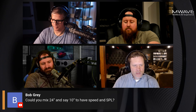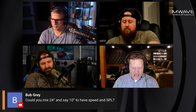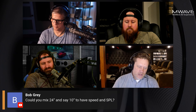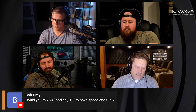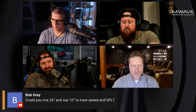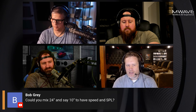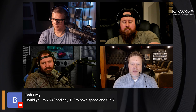If a subwoofer is doing the right Hertz, if it's doing what's asked for, it's going to be on the money with speed. There's a really good article on this on the database that explains it. Historically, some of the reason people think a big subwoofer is slow is because years ago, a lot of big subwoofers had the same size magnets as the smaller drivers. They weren't really built very well — they didn't use the right size boxes, so the drivers weren't under control. Cone excursion wasn't controlled well, causing overhang and extra distortion. That's not the case anymore with modern drivers.